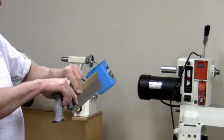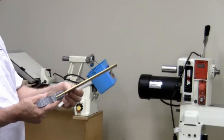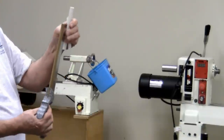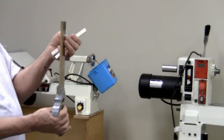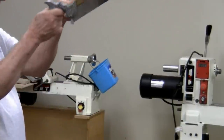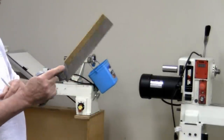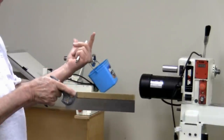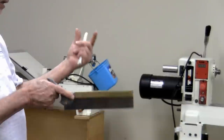So, this one has a very heavy spine. It's got a heavy handle. It's well hand sharpened. It's got one thing I really like. It has 22 teeth per inch, and there's 2 inches of those right at the front. They're no set, which means the teeth don't go out like that. And this is absolutely wonderful for starting your saw on the pin of a dovetail, because that's the hard part to cut. It's got to fit into the tail.